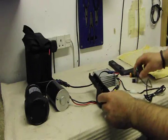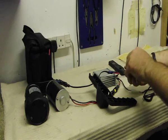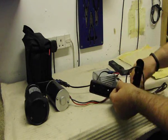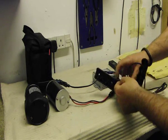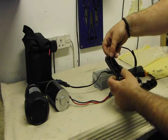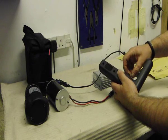The pot end — the speed control end — once you have this done, you just have a little 10mm nut here. You can back that off and you'll find that the pot will just slot into the handle like so. Pop your washer and nut on this end and give that a tighten. You can tighten that up, tuck it nice and neatly inside the handle, run your wiring down through your trolley and connect your handle together with your speed control on there.